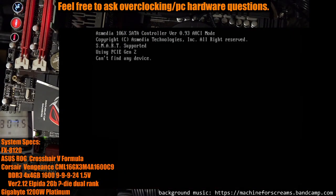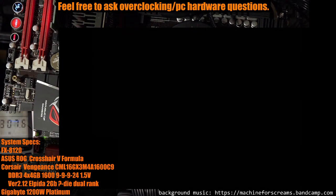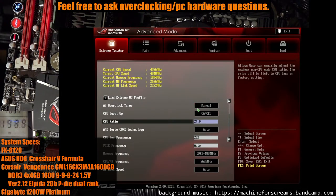I have a huge variety of DDR3 memory chips. Because DDR3 is cool in that you have a lot of interesting different memory chips, whereas with DDR4, most of the memory chips behave very similarly, and then it's just how badly they clock. Like 4 gigabit EDI and 4 gigabit DDI from Samsung for DDR4. What's the difference between them? EDI is just better. They do very similar timings, and EDI just outclocks DDI. Period. There's really nothing more to it than that. Imagine if DDI clocked higher. That's EDI, basically.